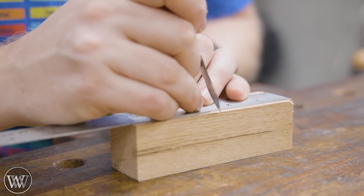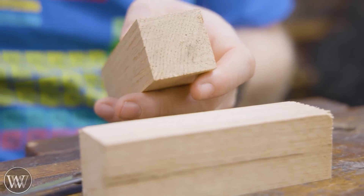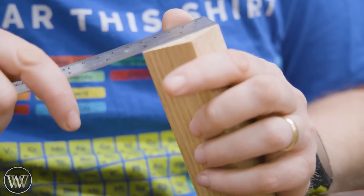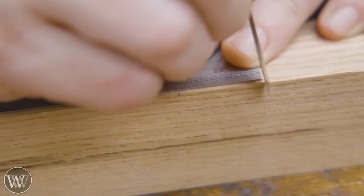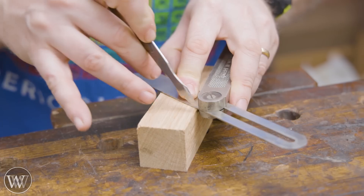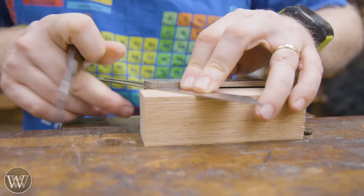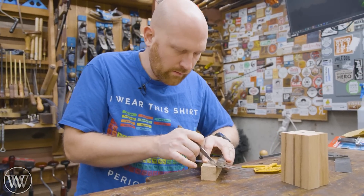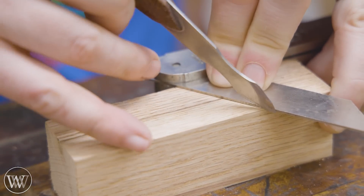This is going to be made by cutting two bird's mouths into the corner of each one of these. I need to find the center mark, then know the diagonal width of the board and move out from that center point that much. I want to leave a little bit of gap in the middle — about an eighth inch — so I'm starting about a sixteenth inch away from the center line. The miter gauge is then set up to about 55 and a half degrees. I don't really care about it being dead on. Having a good compass to figure that out really helps things out.